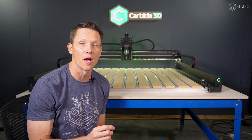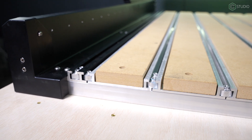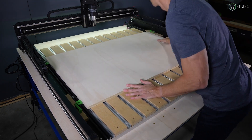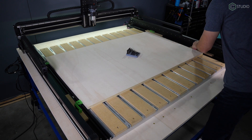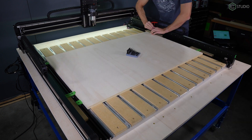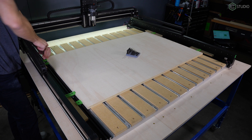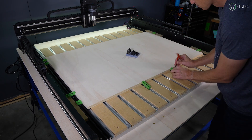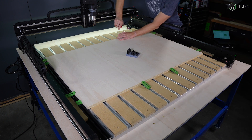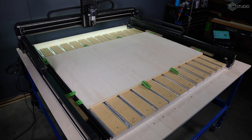Speaking of cutting a whole sheet of plywood, the T-track has actually been expanded on both sides. You need a way to hold the edges of a plywood cut, or a cutout if you're making flat pack furniture, something like that. There are two extra rows of T-track outside of the MDF surface — this is true of every one of the machines. The bit setter lives out there, and other things are going to live out there as well. Want to hold down a huge thick slab for flattening? You can throw 8-quarter material in here, clamp it from the outer edges, and flatten that thing all the way across.